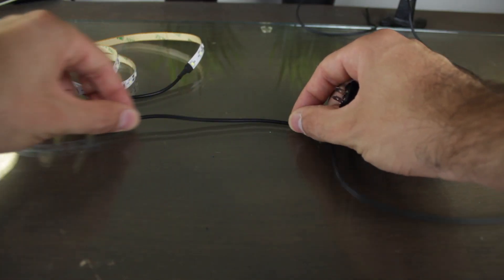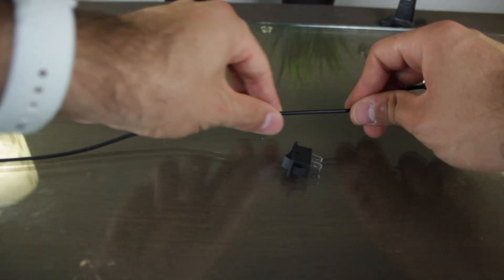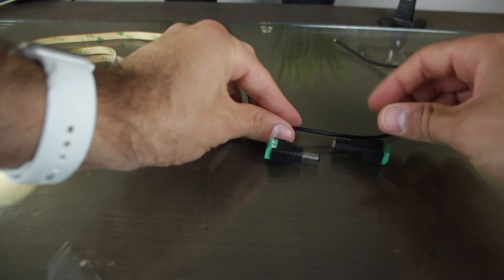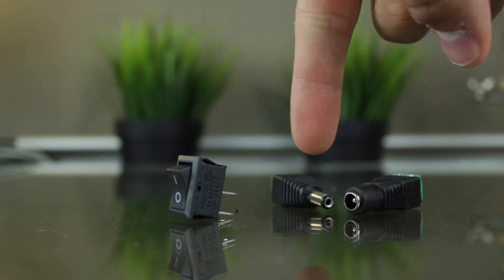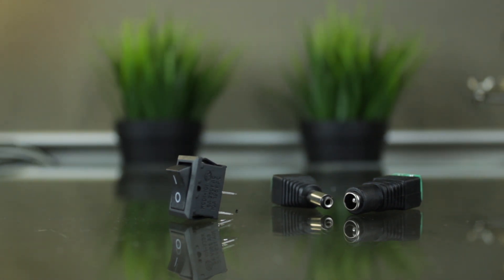Next, we just have to make the installation that connects the LED strip to the power supply of the printer, going through the quick-release power connectors and the power switch. I'm going to take a piece of cable and measure where we are going to place each component. We can connect the cable to this end of the LED strip, pass it to the power switch, then drive it to the power supply, and right on top of the power supply we will place the quick-release power connector. Here I have both components — the male and female power connectors — as well as the power switch. Both will be linked down in the description in case you want to buy them from Amazon.